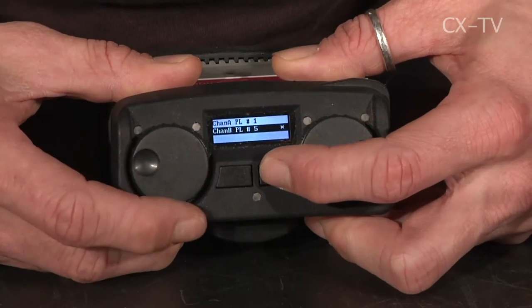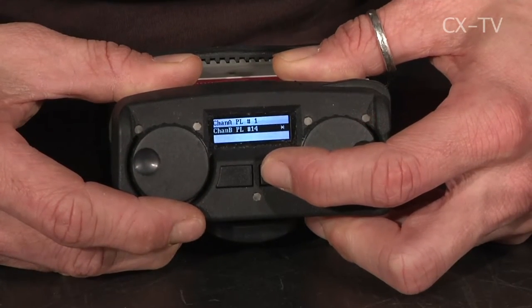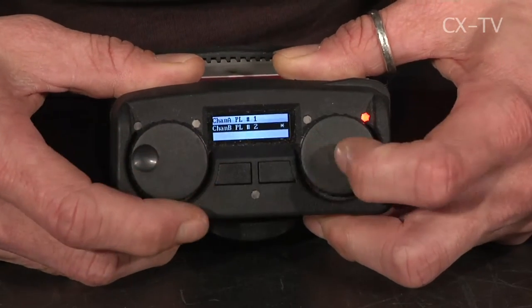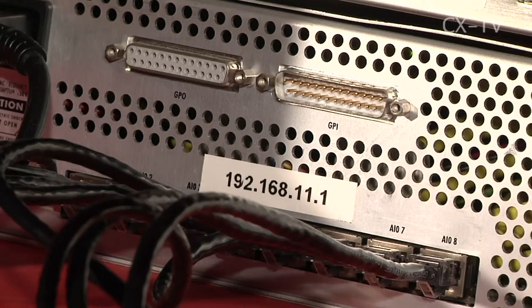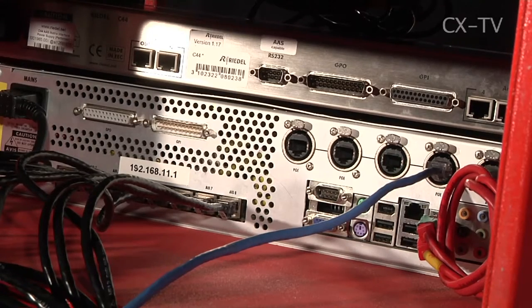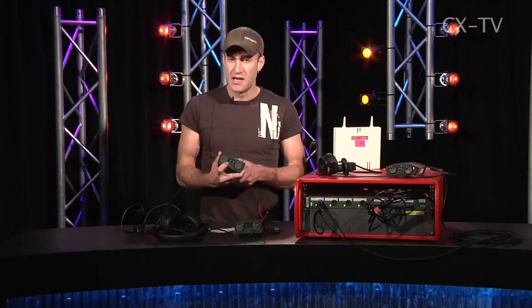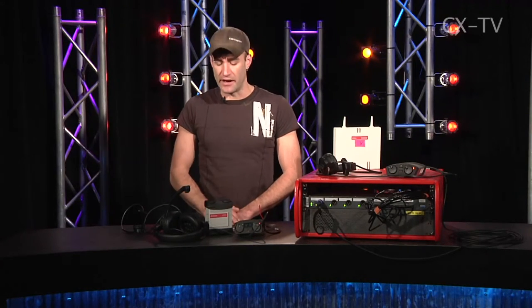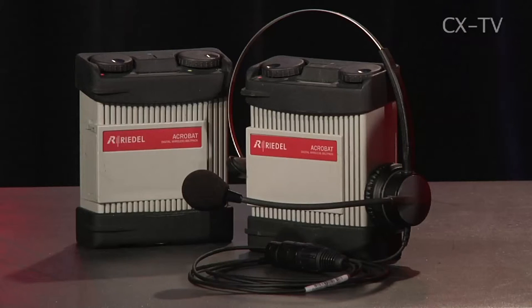The push functions also serve as menu enter and escape buttons, and you navigate through the menu using the call and s-call buttons. There are also GPI and GPO interfaces on the back of the CC8. A GPI is basically a relay or contact closure, and you can set up the system so that when you press a call button on any of the belt packs it triggers a contact closure — useful for a foyer bell or paging system. So you can control things outside the wireless system from within a belt pack, which is pretty cool.